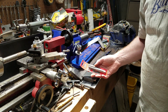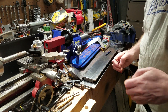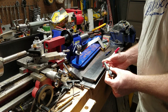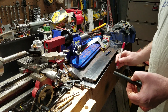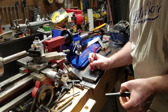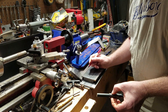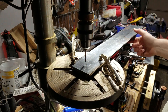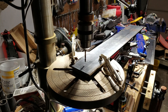I've got the tap. I'm going to do the external threading on the lathe, but for the hole here we're going to go for an 11/16 pilot hole — probably just on the quarter inch to start and then go up to 11/16, ideally for a three-quarter inch thread. I think it's 21/32. We've got the bar all squared and centered on the drill press, ready to go.